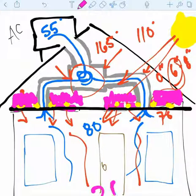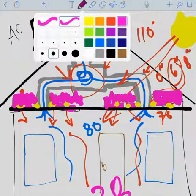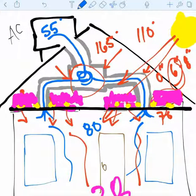proper levels as well. And so in Arizona, your insulation levels should be 12 to 15 inches. Essentially what you want is an R-value. The code is R38. We always work for R44. We want to get people over-insulated so that even as it settles in time, we can still have that proper R-value to help slow down that radiant heat that's coming in.